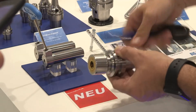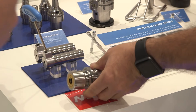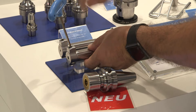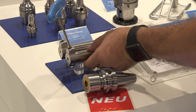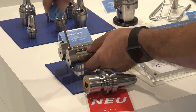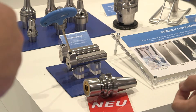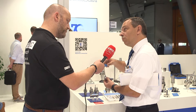The biggest advantage of the HydroChuck is that the customer can change the cutting tool very quickly using just this one screw. If you turn with the wrench until the end, the cutting tool is clamped. Open the screw and you can change the tool quickly. One of the biggest advantages is the repeatability — not only the run out, but the position of the cutting tool is every time at the same height and position. We are talking about 2-3 microns.